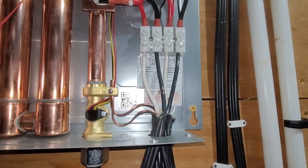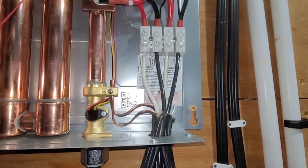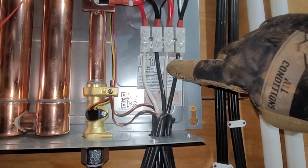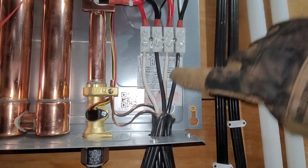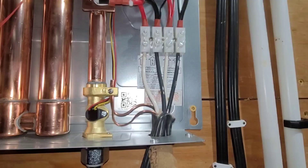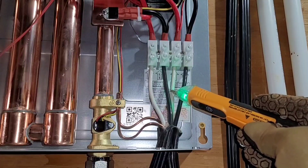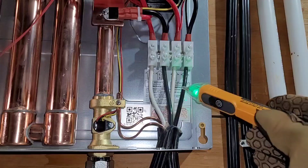We've run our electrical lines through the house and they come up and around and get screwed into the terminals. The black wire goes on the right side, which corresponds to the black on the water tank. The white wire — just what was in my set — connects with the red. The same thing for terminal 2: black goes in with the black line, white goes in with the red. The grounds tie into the ground post. Whenever you're dealing with electricity it's important to test whether lines are live — I use a simple inexpensive voltage detector that beeps on live wires.